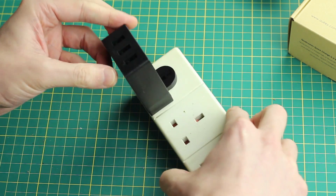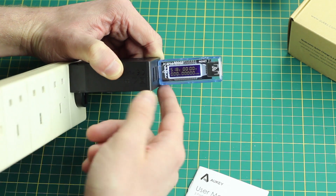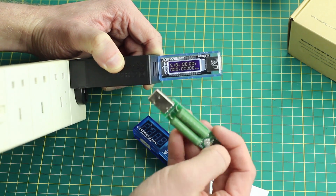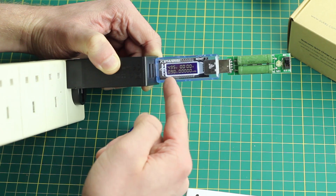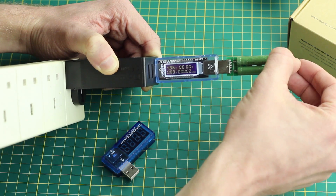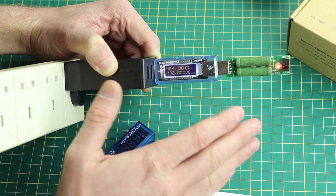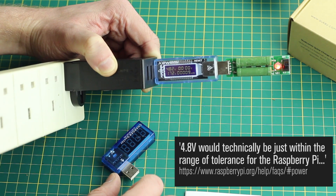There we go — we've got a little LED light showing. Let's plug some stuff in. So we've got a little USB power measurement thing, the USB Power Doctor. I've got a couple of these so we're going to plug two into this. I also have some USB load sticks — this one will go 1 amp and 2 amps. So currently we're going to be drawing around an amp. This isn't massively accurate, but you can see we've dropped to 4.9 volts. If I switch it to 2 amps, it's gone to 1.72 amps drawing and it's dropped down to 4.83, which is still roughly within spec and certainly acceptable for a Raspberry Pi or something like that.